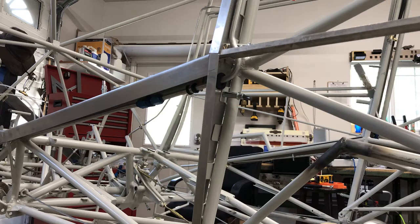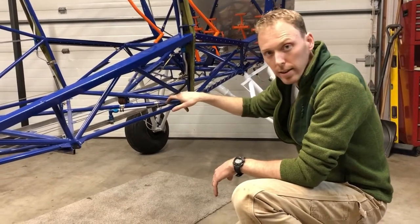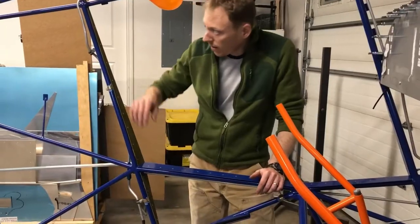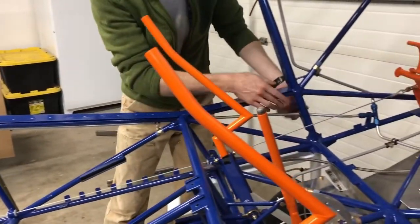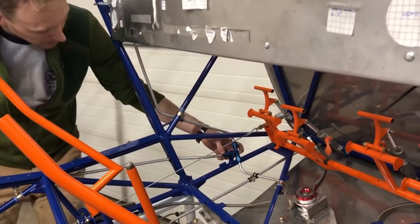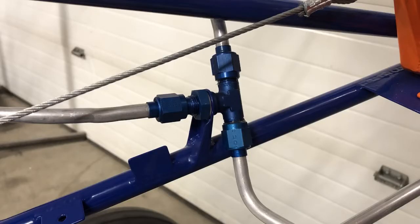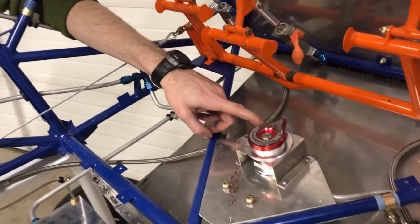On the other side, it's just a simple curve through the aluminum former with a rubber grommet, where I put a union connection for future maintenance. From my T, it runs down and goes over the control cable underneath the floorboard to an extra drain that I put in — I'll explain that later. From this aft T, you can see the line moves underneath the door former, goes through this forward door frame former, and then meets the front line which goes by the instrument panel down at this bulkhead T.